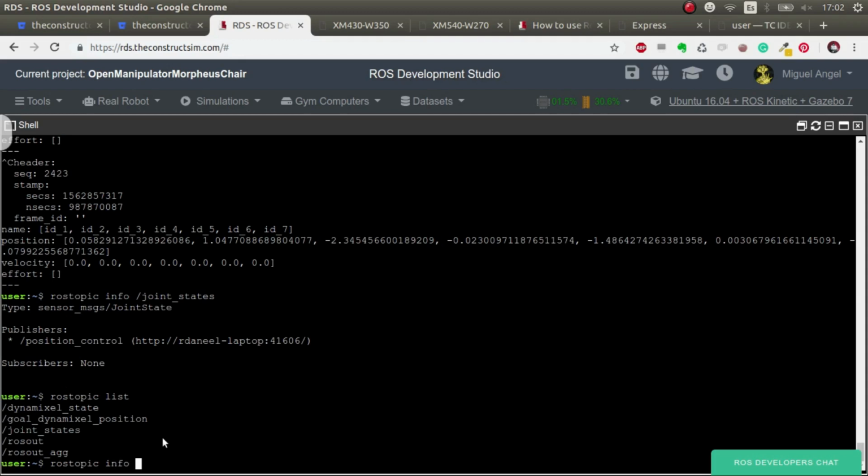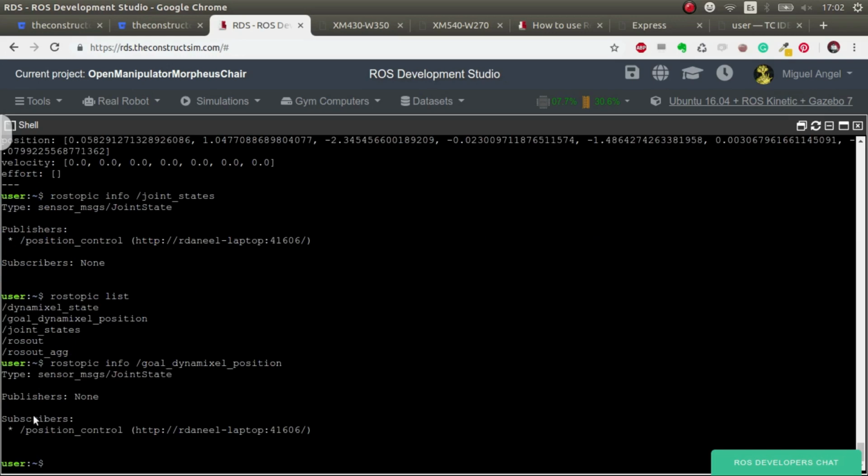And finally, we have this last ROS topic info, goal Dynamixel position. And you can see that there's no publishers. That's because it's a subscriber. So essentially what we are doing is we have a node that is the subscriber, which is position control, that is listening to this topic. And when we publish something here, we're going to move the robot. So if you have any Dynamixel connected with this setup, you can do this exactly the same way. So let's have a look.